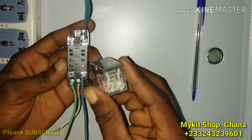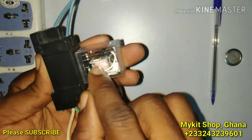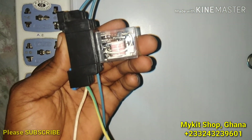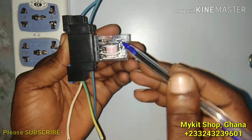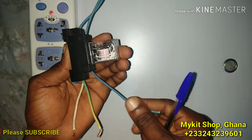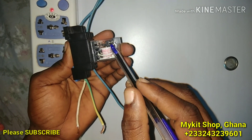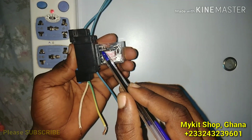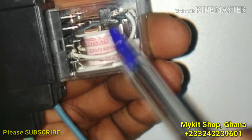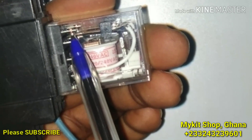This is the socket for it and this is the valve itself. You can see this is the coil right here. If you have power on this side, you feed the power here and then it flows to the stem. You can see the rod here and it switches between this or this — between two positions.